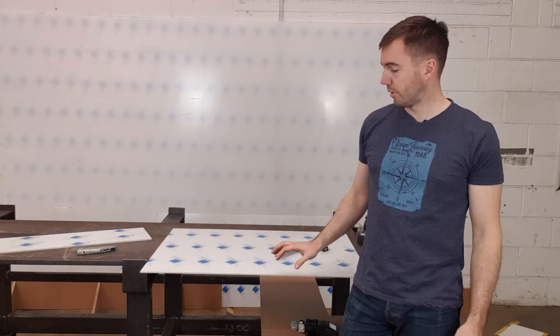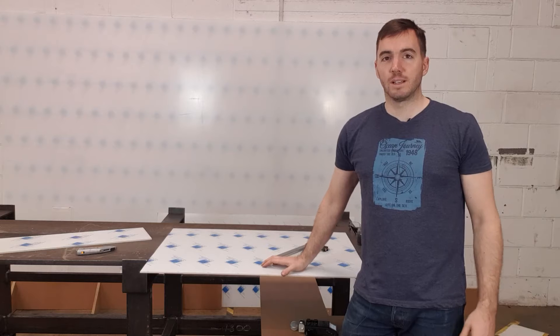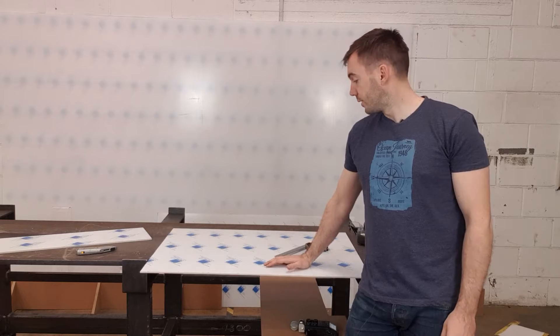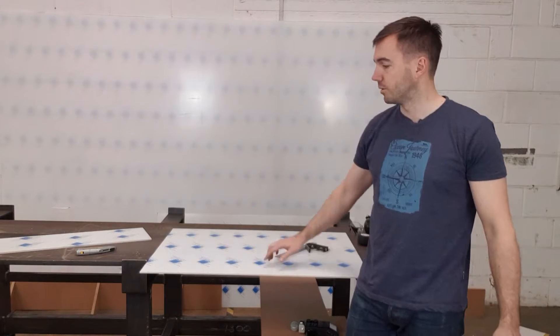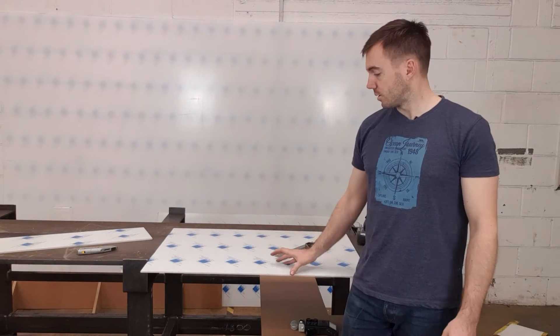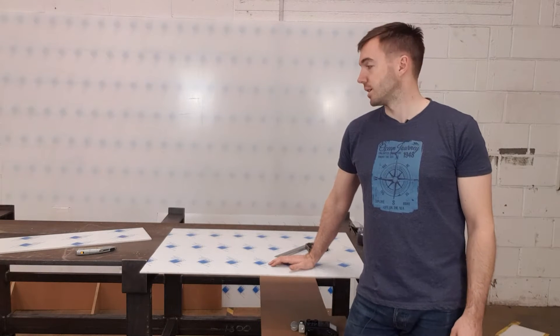Hello and welcome to this video where I'll be showing you how to cut acrylic panels using a jigsaw. The best ways of cutting panels are using either a laser, a water jet, or a purpose-made machine. The alternative is also using a scoring knife — you can watch my other video on that — but now I need a cutout of 300 by 150 millimeters, which is not possible to make using a scoring knife, so I'll be using a jigsaw.